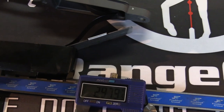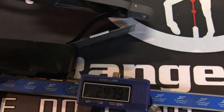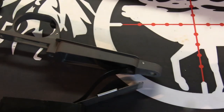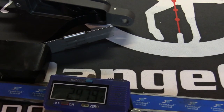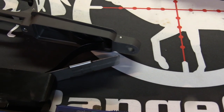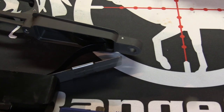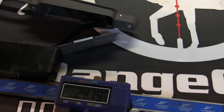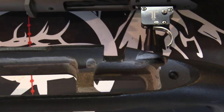The magazine box from the Blue Mountain Precision 6.5 PRC measures 2.979 inches. The factory ammo at 2.950 inches fits and feeds fine. The ammo Eric put together for the rifle also cycles through very well. It currently has a single-stack Wyatt box and follower, and Wyatt has started making a 6.5 PRC-specific follower. When it gets back to the shop, Eric will replace it to make feeding a little smoother. The bedding is beautiful, as you'd expect, and the accuracy shows it.